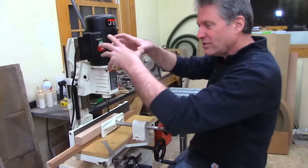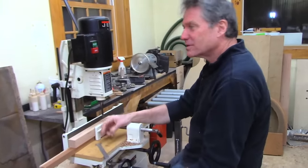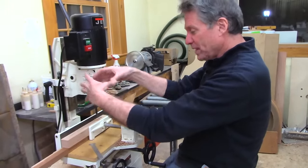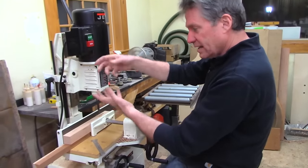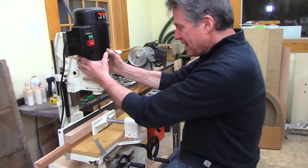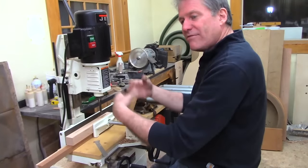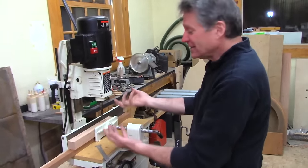When you have that, this hollow chisel mortiser is attached to the spindle, I'm forgetting the proper word, the chuck of the drill press. And then it goes down. You end up with this long apparatus away from the actual mass of the machine, so there's a lot of room for error when you have that type of setup. It's just a long way to go by the time you attach it.